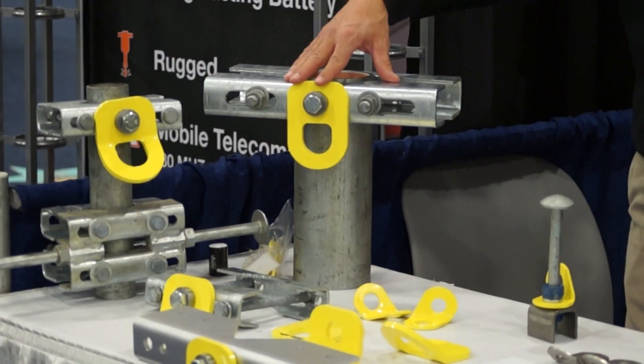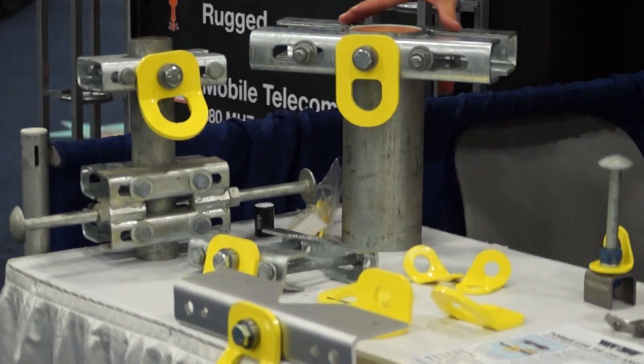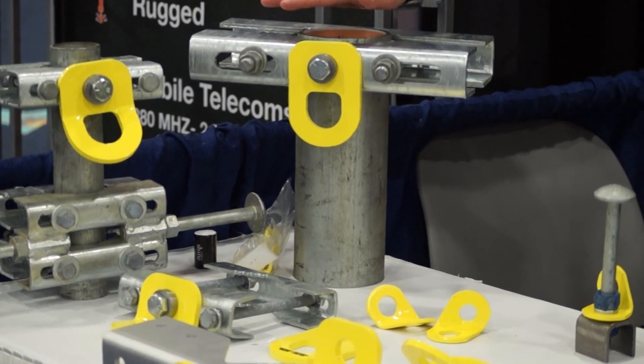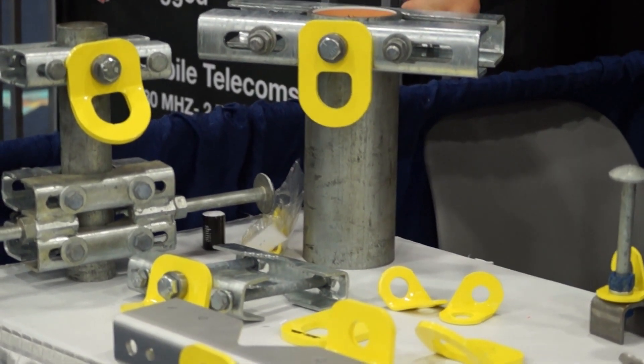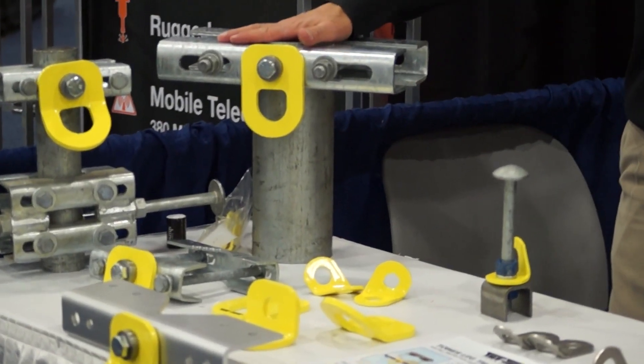If I'm on an opposite leg from the climb facility, I have the capability of attaching a load-rated anchor bracket for the installer or the erector. This is a 5,000-pound bracket — they've all been load-rated and tested to hold a minimum of 5,000 pounds, giving you an engineered anchor point above and beyond anything that needs to be certified. They come from the factory as a certified installation or retrofit system. To put it into perspective with the fatalities in the industry: the climber or technician falls off the tower — he has all of his gear, but he doesn't have anything to tie off to. We look to hopefully make the industry a little safer and promote a much better work environment for the guys that are climbing.